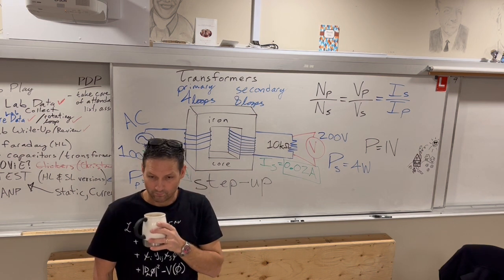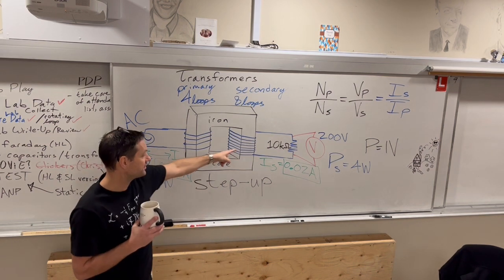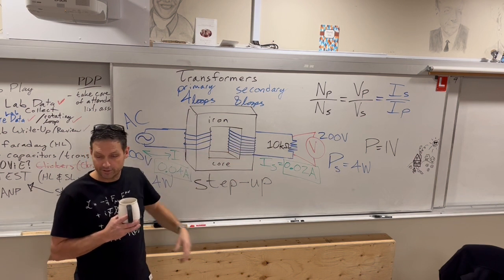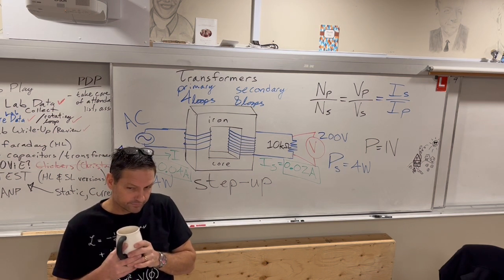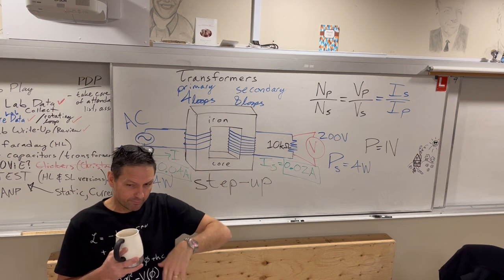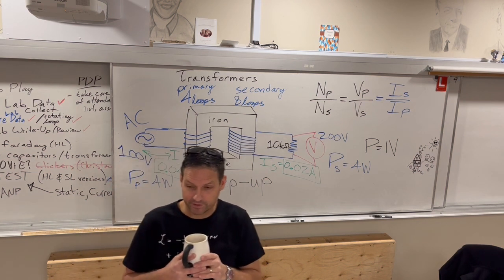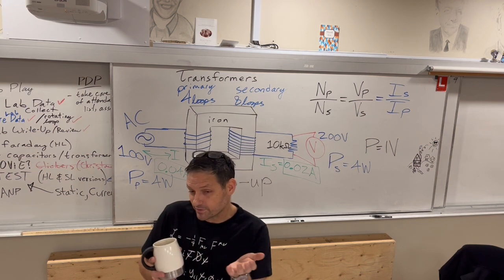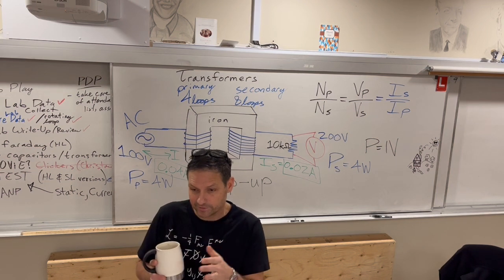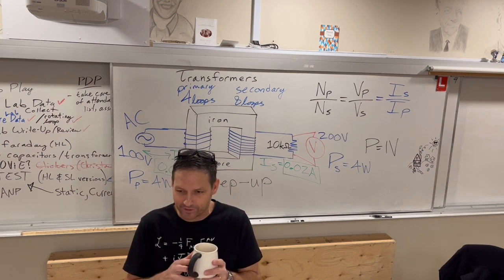Mr. Aspinall, I have a question. If we were to change the frequency of the AC, would that change the transformer? If you have 60 hertz here, you have 60 hertz there. If you have 100 hertz here, you have 100 hertz there. There's no getting away from that, because the flip-flop of the current is the same. Because the back and forth force is magnetic, it's an actual force. That's why you hear a transformer make a noise when you flip it on, if it's not built really well.